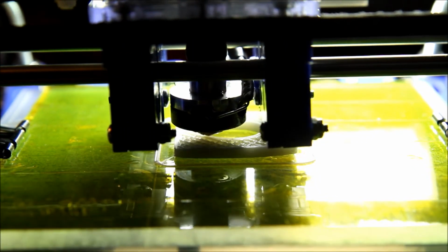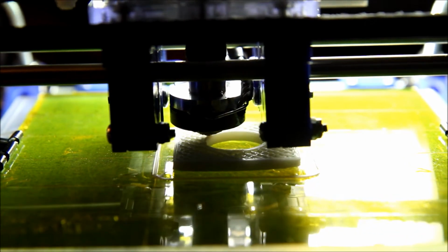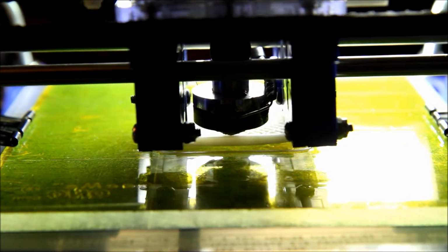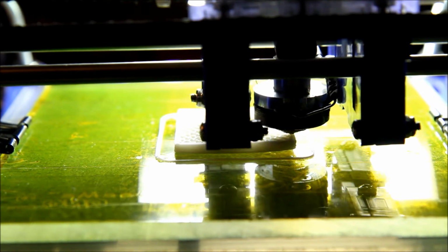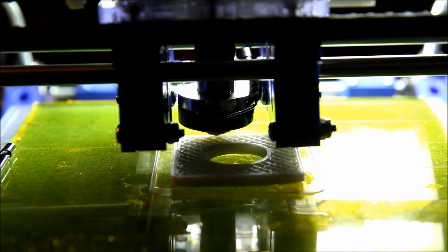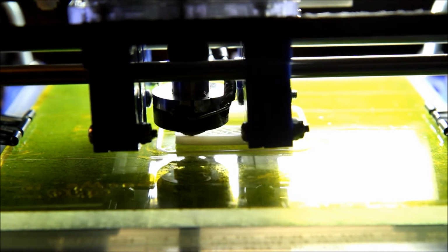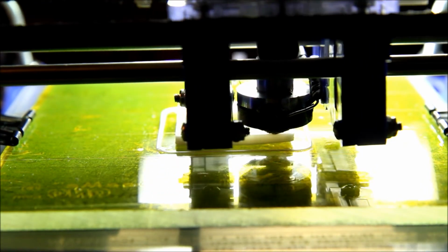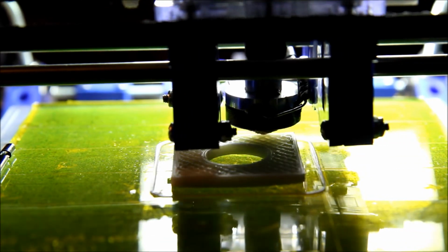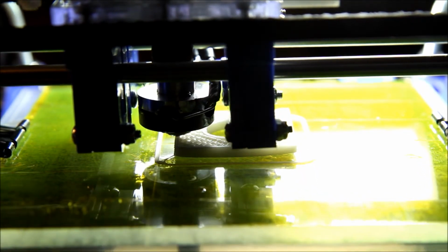That's the extruder making all the noise, the little motor. I have it pretty much to the edge, and sometimes it misses a bunch of steps. Though I'm noticing that the extrusion still occurs with little to no faults. And I guess I'll chalk that up to it still having enough pressure, pushing out the remaining filament that it's already put in the melting chamber or whatnot, so it pushes up. I know it's not perfect. Once I get the rollers hobbed, I'll change it around a little bit anyway, but for now, until it totally screws up, I'm going to keep it running.